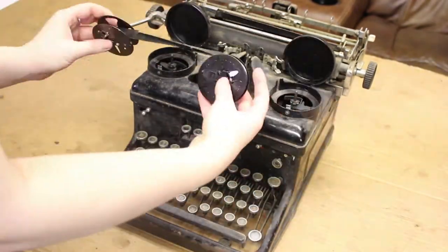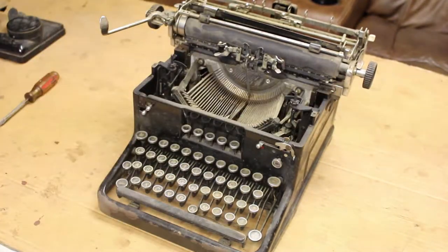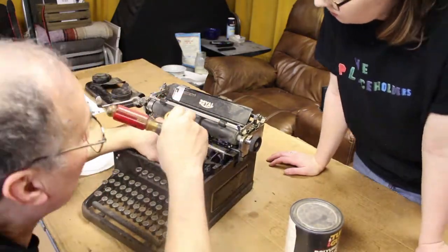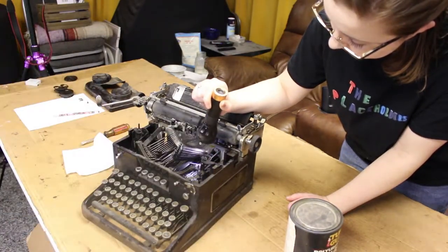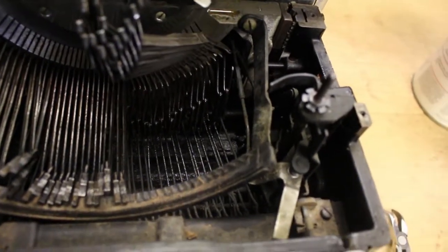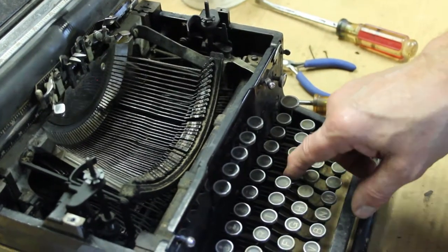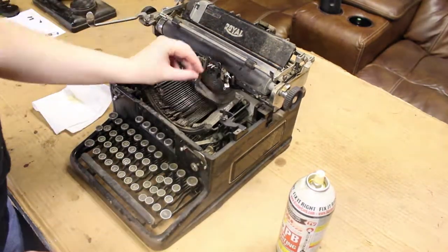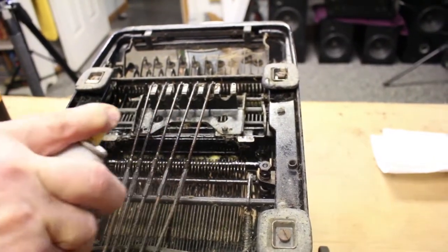We started by taking the machine apart. I removed the ribbon and top cover. After this, we determined that some of the bars inside the typewriter attached to the keys were bent, and we managed to bend some of these back in place. We also found that some of the S-shaped hooks that attached the keys to the moving spring-loaded bars inside were missing on the zero and three keys. We found one and managed to fish it out; the other eluded us until we aired out the typewriter and it fell out. The X key had one of the hooks attached to it unattached. We removed the front panel and used penetrating oil to loosen up the other keys and remove any rust, then let it sit overnight.